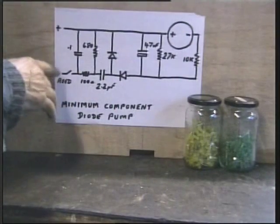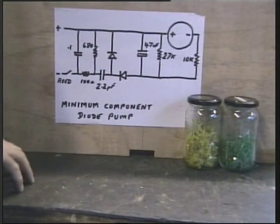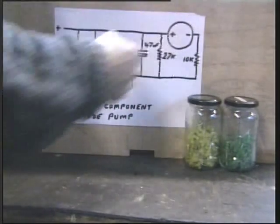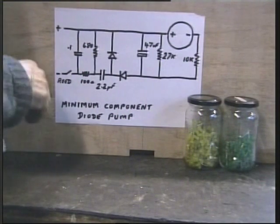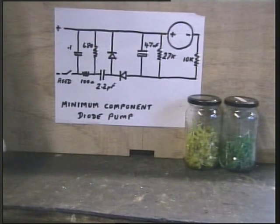The faster the reed switch is switched off and on, the higher the reading should go. If this is too high you can decrease the value of the bleed-off resistor, or you could shunt the meter. If the reading is insufficient, you could add another magnet, which would double the pulses to the diode pump. The best way of calibrating this is to get a passenger to hold the anemometer up through the skylight of your car and drive at a steady 30 miles an hour while adjusting it. The rest should be pretty linear.